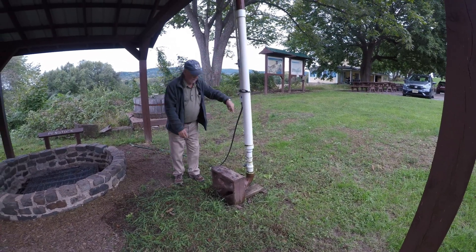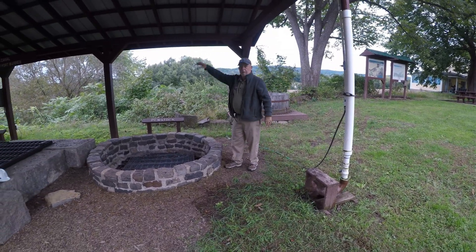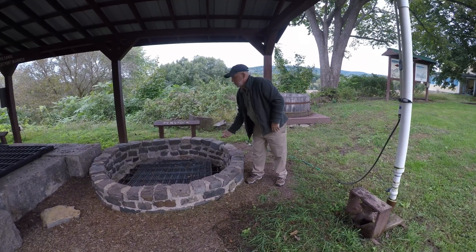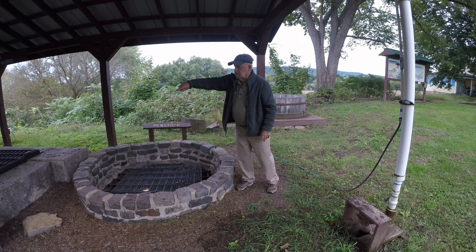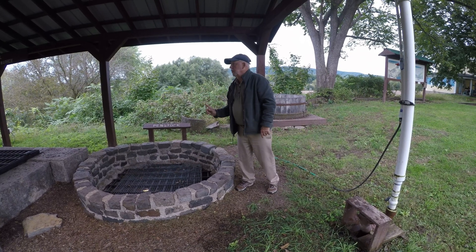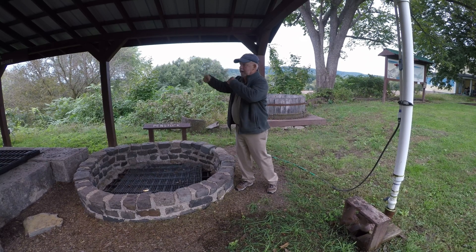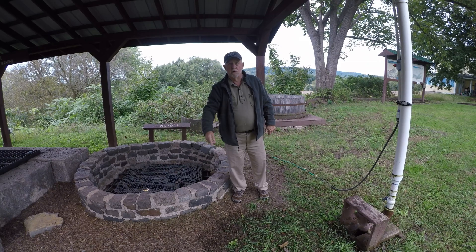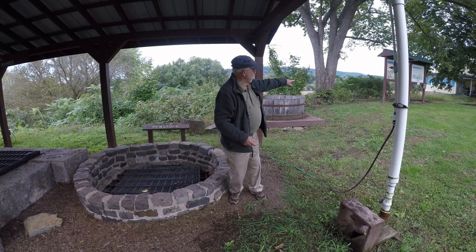This tube is analogous to this tube — a 47-foot head of water comes down and up underneath the turbine, spinning it in that direction. It had a shaft above ground to a pinion gear and two ring gears, which could be fastened to a large drum, 13 feet in diameter, and around that drum was wire rope.